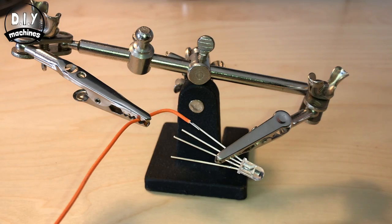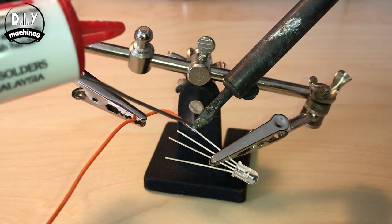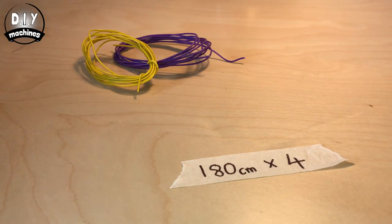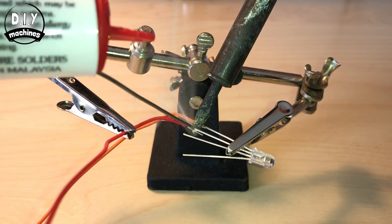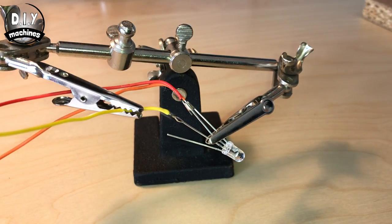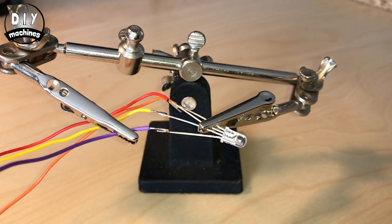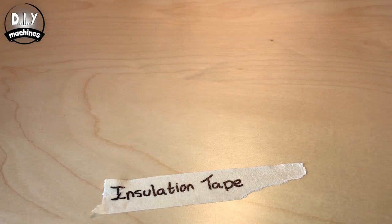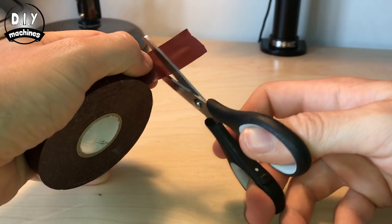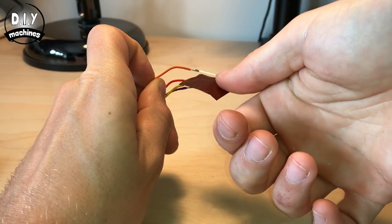It's well worth using four different colour wires when attaching them to your LED. Take note of which colour you attach to the longest pin. This is the ground or cathode of the LED and you'll want to know which one this was later on in the project. Add a piece of insulation tape around each of the pins we've just soldered. This is to prevent any short circuits later on.